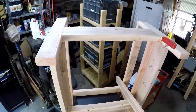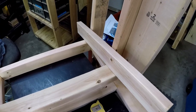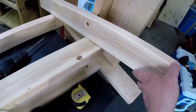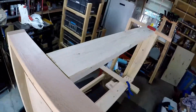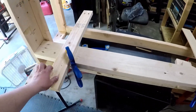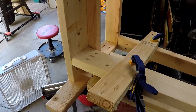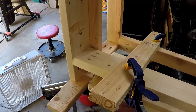To figure out the angle for the back piece on the bottom of the seat, I simply put it in place at the right distance from the front rail, then used a straight edge and tilted it until it contacted the top of the back rail, and then screwed it in place. I used the same process for the loveseat. The one straight edge with the pocket holes at the end was a center support for the loveseat.